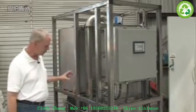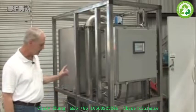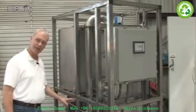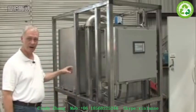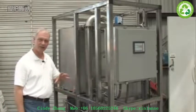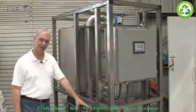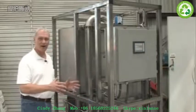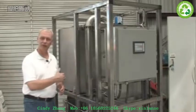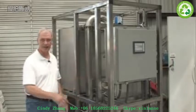One of the things that we can do with this system is recirculate the beer if we want to. By doing that, we can actually run the beer through the distillation column. The still bottoms that come off, we can actually rerun those automatically if we want. One nice thing about this new model of our lab system is that it has a completely self-contained closed-loop cooling system — that's what that radiator and cooling system is for — which really makes the entire unit able to be standalone. Our previous models had to have external cooling water lines run to it. This one is completely self-contained, which is a big plus.